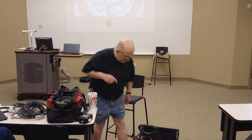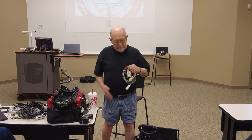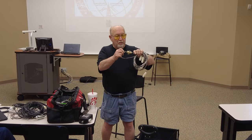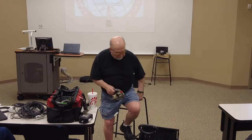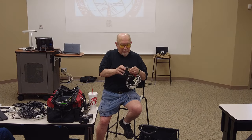Now I have seen it, well, like this one. This one is a 10 and 15 meter antenna I built in the field. As you can see, it's not very pretty. It wasn't designed to be built like this. We got out on field day with a group that was going to come out and work 10 to 15 meters, and they didn't have an antenna. So I said, all right, I'm going to build them a two band antenna. So that's what I've got. I've got a 10 meter dipole with white wire and a 15 meter with black wire. And we just tied ropes on each one of them, put them up in a tree, and that's what they worked field day on. So it's not pretty. It's kind of ugly. But it worked.